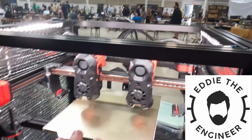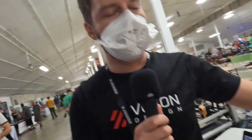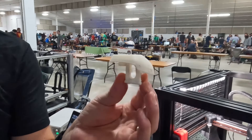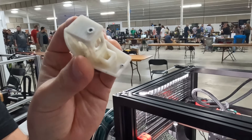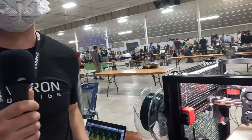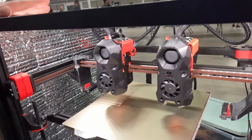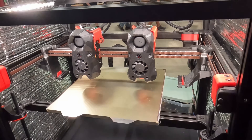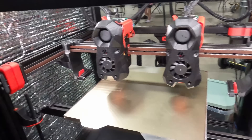Eddie, how's it going? What have you created? What is this? I'm seeing double. Yes, you are seeing double. So this is a Trident, but it's a Trident IDEX printer. If you think about prototyping for any industrial setting, generally you're going to want soluble filament. You can print a benchy upside down — this was printed like this — and those surfaces that are actually upside down are really smooth because I was using soluble supports. This is really the holy grail for printing higher quality parts, especially if you're doing an injection molded part. I always knew I wanted to build an IDEX printer, and since Steve did such a great job on the Trident getting it refined, I took his design and created a two-head version, changing the NEMA 17 motors in the back to two NEMA 14 motors and adding some additional belts on either side to handle the Y axis movement.